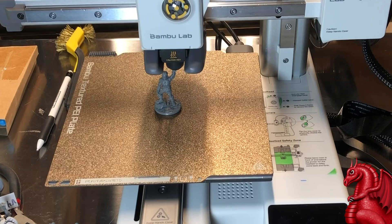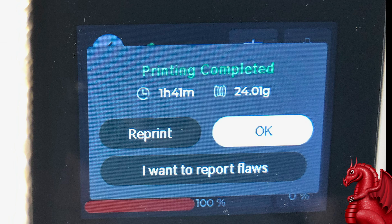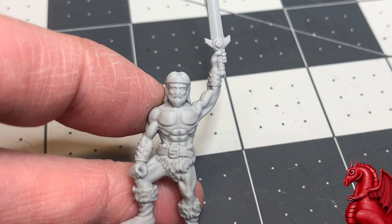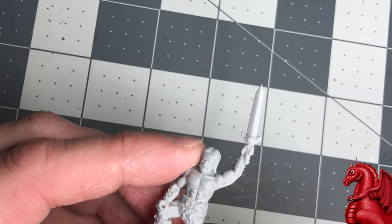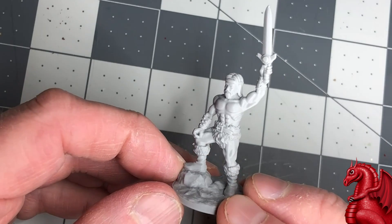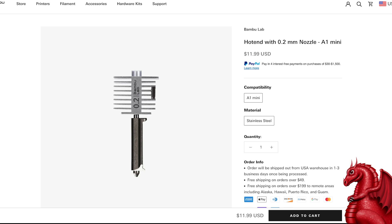How does it print? Starting with miniatures: it can produce a standard 28mm mini — this barbarian printed in 1 hour 41 minutes at 0.08mm layer height, and as you can see it is absolutely smooth. You have to get it under magnification to see the layer lines. This is done with custom profile settings I'm developing, which I'll release in about a week with my next video specifically on printing miniatures with the Bambu A1 Mini, using Hatch Box filament at 0.08mm layer height.